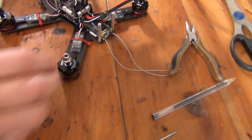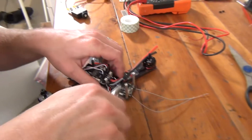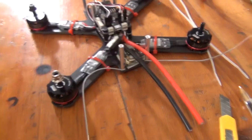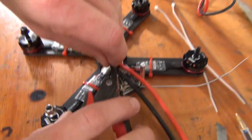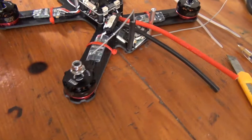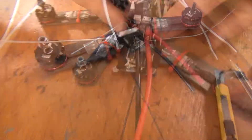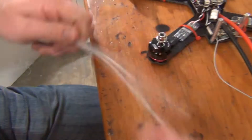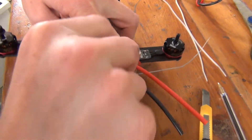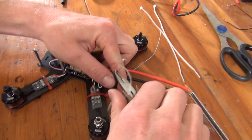Make sure that the antennas are facing outwards towards the rear of the frame, as we're going to route those up the standoffs and away from our propellers. To do so, cut a piece of heat shrink to the length of your standoff. Fit the heat shrink over the standoff, and then run the receiver antenna between the two. Repeat this process for the other antenna and standoff. Next, grab two zip ties and run them up the same path of each standoff. These are going to be the supports for the antenna above the frame.